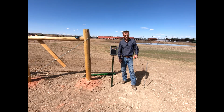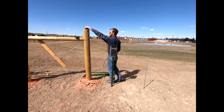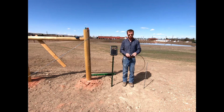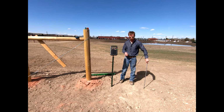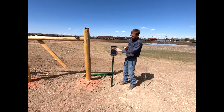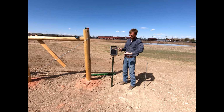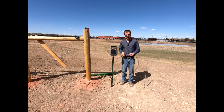Again, you've got 3 rods in the ground. They're all connected to each other. Now we connect this last rod to this energizer. One way I'm going to show you is this kind of temporary solution that we're going to do today, and then traditionally what I would normally utilize. In a normal situation, I would use that insulated wire that you guys previously saw the roll of. We would connect this to our last grounding rod here. I'll show you that ground connection clamp, and then we would take this and bend it around our green earth terminal right here, and then make this ground connection to the energizer, go down this post, bury it underground, back to our ground rods, nice and clean, don't have to worry about anybody tripping over it, okay?